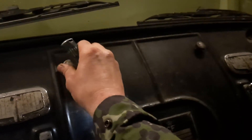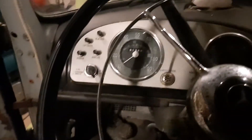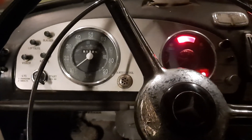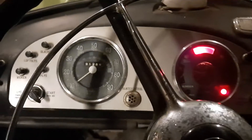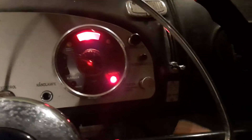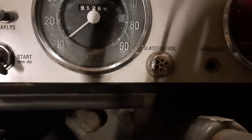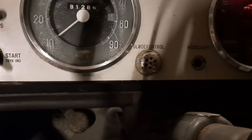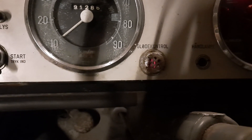Let's get it started if we can. There we go. It's a standard procedure for something like this. You see the key there? Push that in. So far we've made electrical contact. Secondly, there'll be the starter button, which is right here — you pull it out just halfway. And we look here in the pepper shaker as we call it, and when that starts to glow, the preheater would kick in. I think I'm spotting something in there — oh, there you go, see? Turns all red.